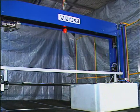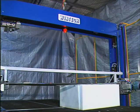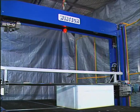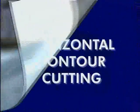One of the great advantages of the Wintech machine is that the block, with all of the contour cut shapes in it, can remain on the machine, and the second blade then used to cut to width or height. This is simplified even further through Wintech's powerful Profiler software, which generates a slicing program simply by specifying the width of the slice and the block size. All that then remains to finish the job is just to press the Go button.